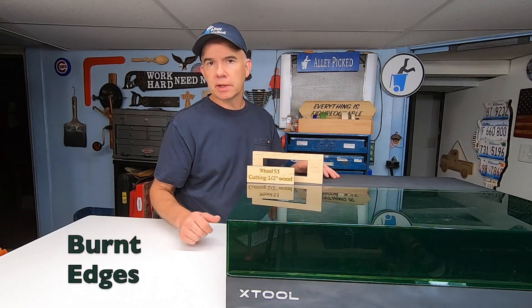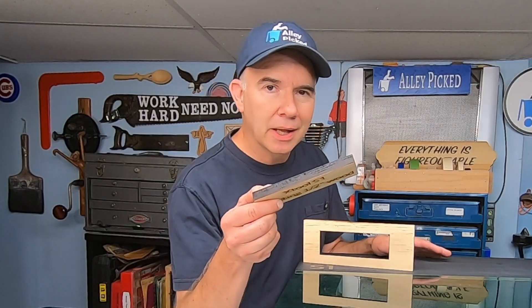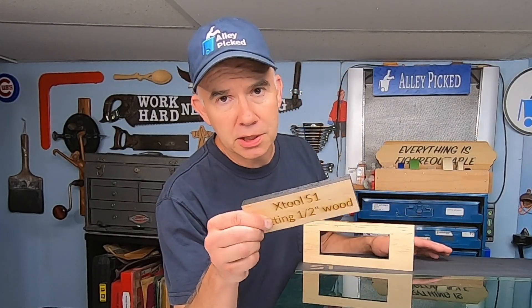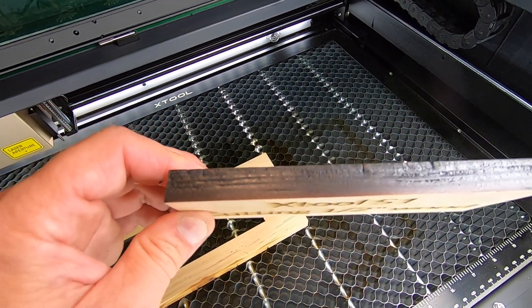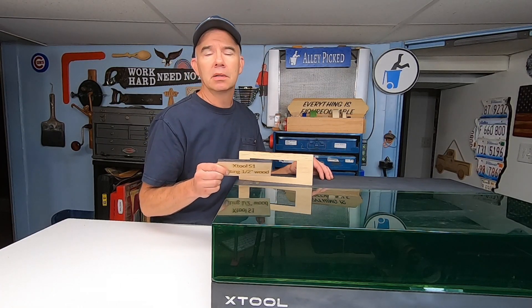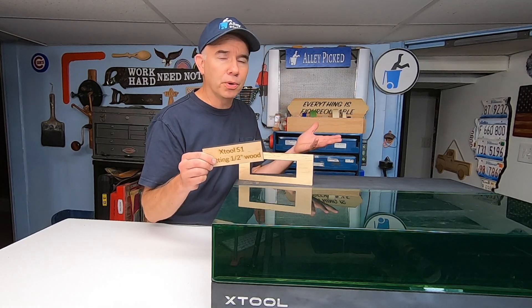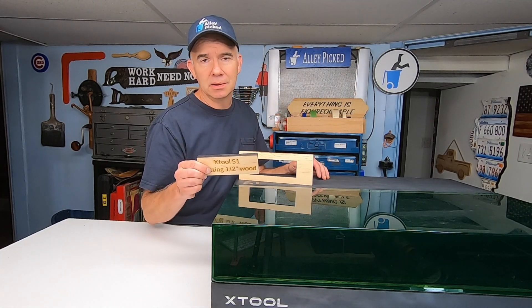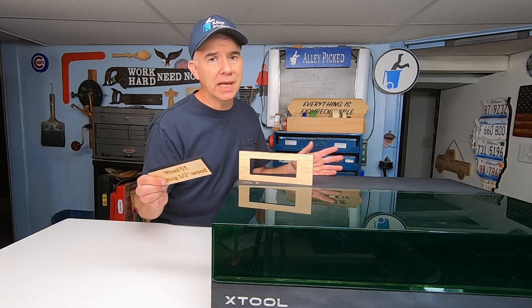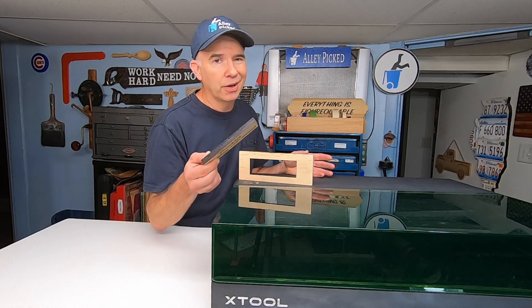Another problem that you don't hear a lot about is that when you use a diode laser to cut wood, it leaves the edges looking like charcoal. I used this machine to cut half-inch wood, which is great, but the edges literally look uneven like a piece of charcoal, and if you touch it you're going to get that all over your hands. The only way to get rid of it is to sand it off, and it does give off an odor which you have to seal or you're going to continue to have that smell. If you do want a clean-cut piece of wood, just use a table saw, but understand that if you use one of these machines, the edges are going to look black.